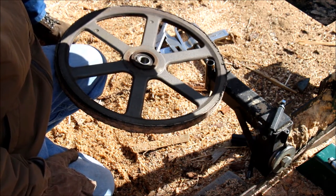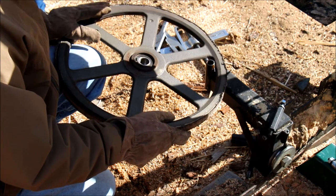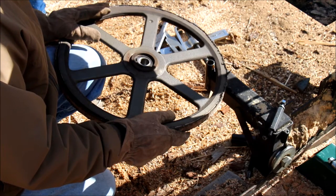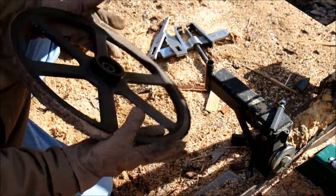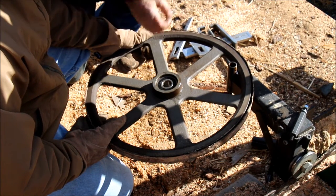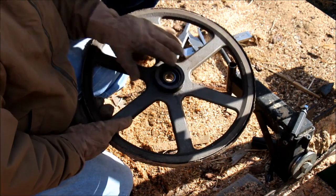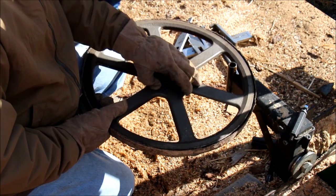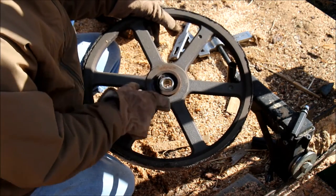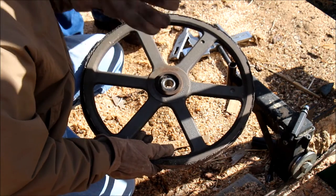There are two bearings in here. Replace both bearings — they're probably the same part number. One goes in one way, one goes the other way. Good thing I've got two. They're just pressure fit, so you should be able to hit them out with a hammer using something that fits. We have the full bearing kit, so we can put a big sleeve on the outside and press the bolt out that way. There's got to be a shoulder where you press them in — you only go so far.